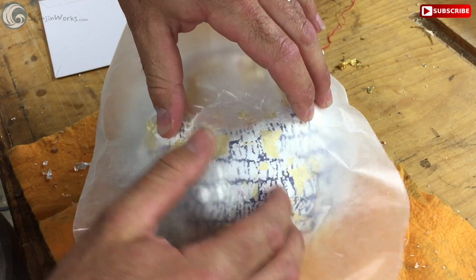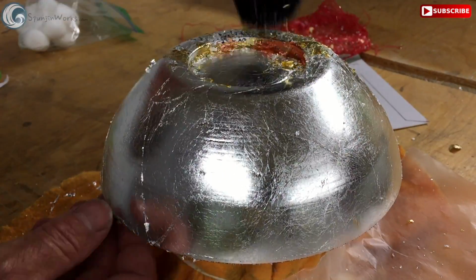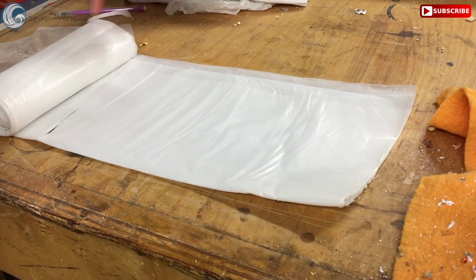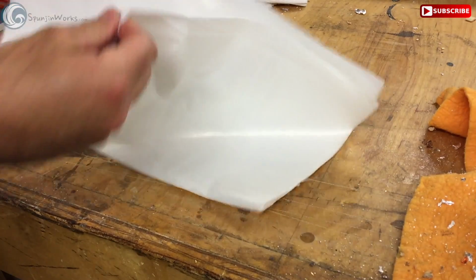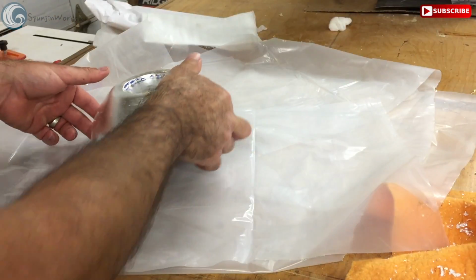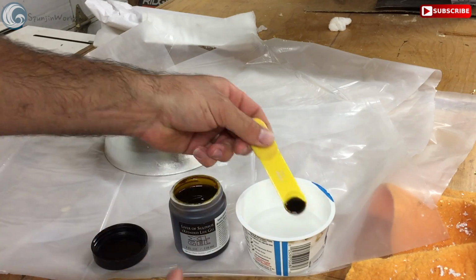My preferred chemical to add a patina to silver is liver of sulfur or potash sulfurated. It starts out turning the silver orange, then red, then green to blue, and eventually black. It all depends on the strength of the solution and the time in contact with the metal. I use a 1/4 cup of water to 1/8 teaspoon of chemical.